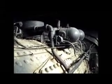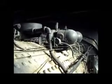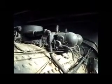It's the dynamo. A lot of smaller locomotives have just one dynamo. Some of the other ones, especially passenger locomotives, will have three dynamos to run all their appliances, and sometimes passenger cars, although that depends on whether the passenger cars went off steam or not. Anyway, I'm going to go back down to the bottom and show you the injector, as well as a close-up of the cold water pump.